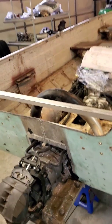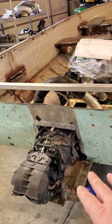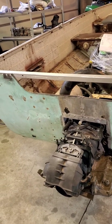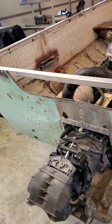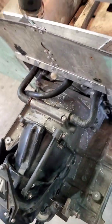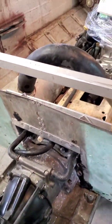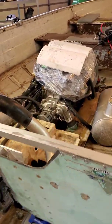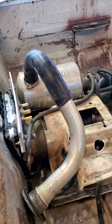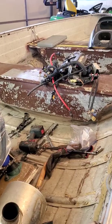We've got our Sea-Doo nozzle fitted right on there — no problem. I expect it to be perfect with no issues based on how it lined up. One thing to note: I lost my automatic bilge because of the nozzles, so if you're counting on that, be aware. Aside from that everything's good. I've got my controls here so I'll run the cables and see how far up they go. Working on the exhaust now, and I've got the wiring harness.